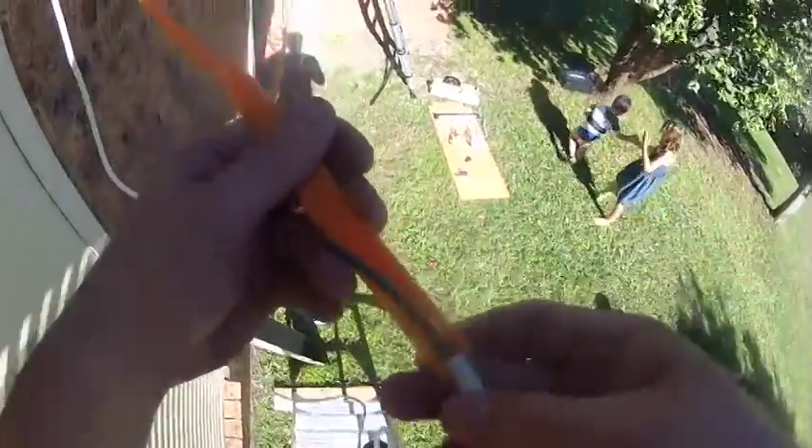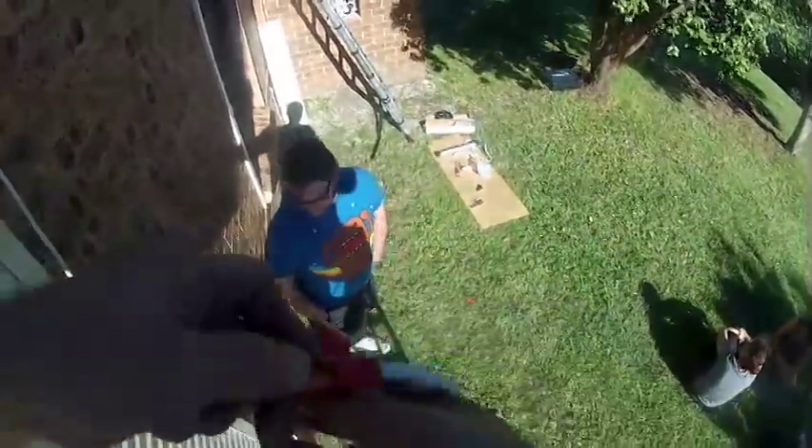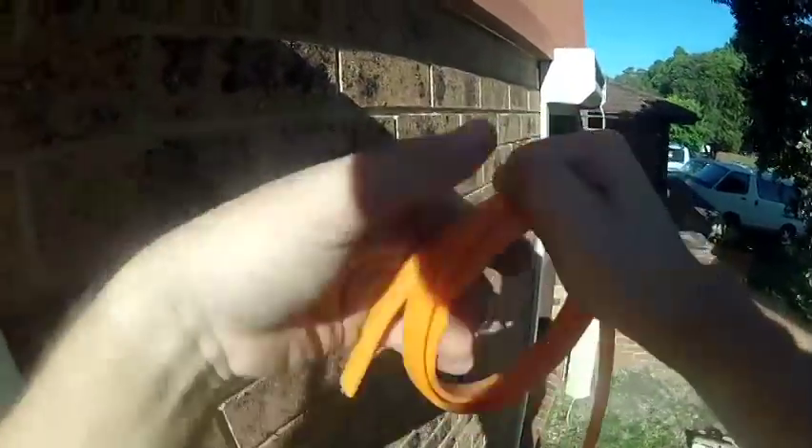Make sure the cable is pointing downwards. Here's the trick for getting the power cable to go down through the wall to the power connection below, or above, or wherever it may be. Get the cable wrapped as tight as possible so there's as little chance as possible of it coming away from the conduit — and don't forget to hydrate. We try to get it down the wall; if it doesn't work first go, pull it out and wrap it a little bit tighter to get a better corner going downwards. Wrap it up nice and tight, let it go, get a nice curve on it, and it goes straight down on the second go.